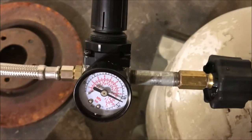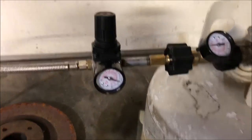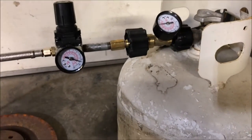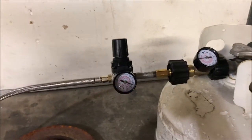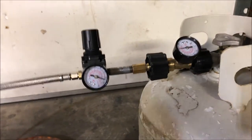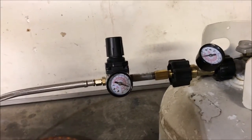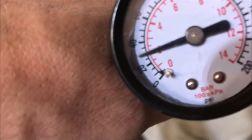My idea to use a cheap pneumatic air regulator as a high-pressure, high-flow propane regulator was definitely a good idea. It's probably not legal, but that's the only thing I can find that'll give me this pressure. This isn't going in anybody's house or anything, so it's going to be okay — but I'm saying you could never hook this up to your stove or any heating system you may build. I don't recommend that, but just for the purpose of running a foundry or a forge, if you're finding yourself wanting more pressure, these high-flow regulators are only about 30 PSI.